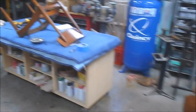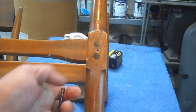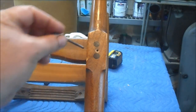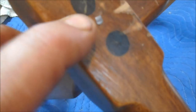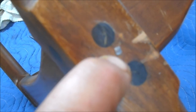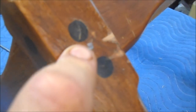So we started with the first one. First thing we did is obviously take the seat off, then flipped it over to start working on it. You can see here is one of the offending joints, and there's a big hole — that's where someone put in a two or two-and-a-half-inch screw to hold the joint together. We know that's not the way to do it. Then I went to the other joint and found a two-and-a-half-inch screw that is snapped off clean, flush with the back of the chair. It runs all the way through this joint, and this joint is loose, so we have to get this screw out of there.